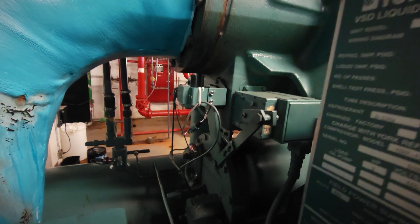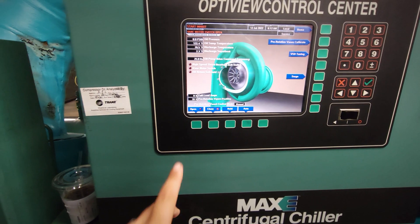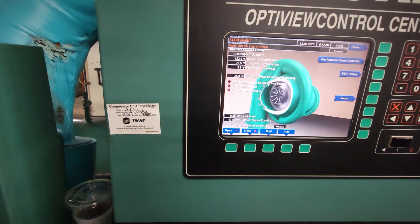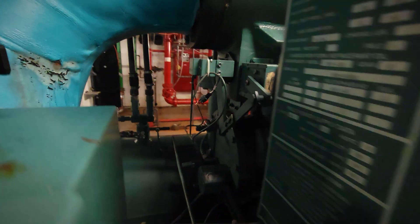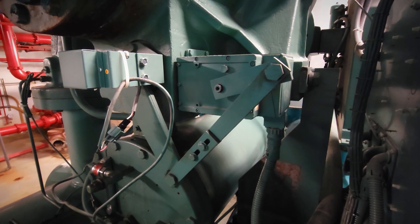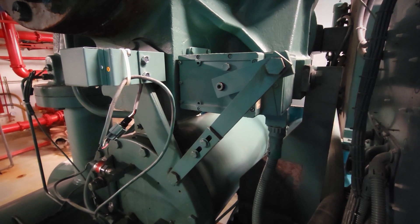Now that we've done this, I'm going to go back to close because I've confirmed that it will start — it'll show open and we are showing a potentiometer percentage. I've verified that we are actuating. We're closing just fine, everything's swinging like it's supposed to. Pretty happy with that.